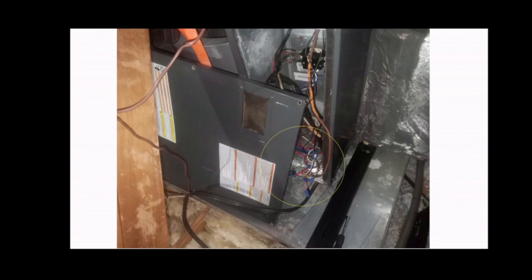It could be that you just have no power in the house, and it could also be a faulty part within the unit or multiple parts. Could be a bad, burnt, or broken relay. Could be a bad, broken, or burnt control board. It could be again a fuse within the unit. There are a few fuses within the unit. It could be a loose connection, whether it's a wire, cable, or a connection to the control board.